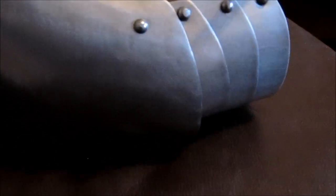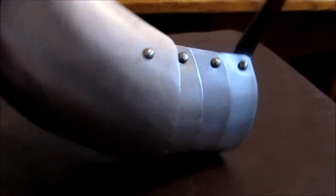The shoulder here — you can see there's dimpling that was done with a ball-peen hammer, and some heat was used to bowl it out a little bit more. As a side note on materials: all my armor is 22-gauge mild steel, except for the breastplate, which is 18-gauge steel.